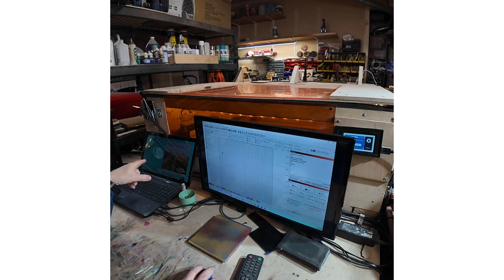And it immediately communicated with the laser. You can see in the console here. This is what was missing in RC4. So it's now showing the correct release of GRBL, sending back some of its status information. It's got the correct buffer size and correctly homed. Again, release 4 didn't do that.